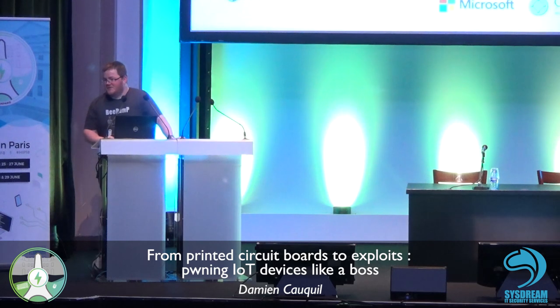Yeah, we got some devices that use pairing in the Bluetooth Low Energy protocol, but it's more difficult to sniff these communications because they're encrypted. Sometimes you get the Just Works pairing used, so it's easier to sniff and crack the encryption and then decrypt all the communication. But in fact, we had to develop some dedicated hardware to get it. This is obviously the subject of a talk I submitted at DEF CON this year that got accepted. So more information to come at DEF CON, I guess. Thank you.